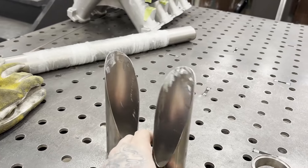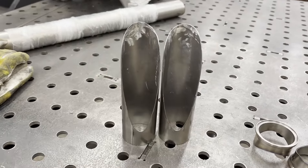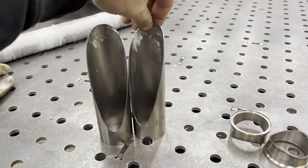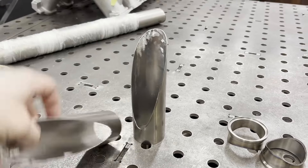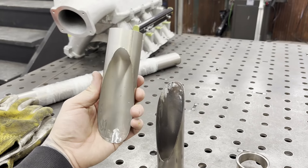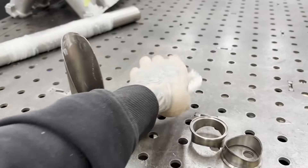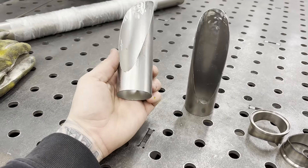This trunk section and straight section are definitely staying in their final position, so any modifications will happen elsewhere. That's why I'm doing the BOV placement now — it'll get two more components placed in their final spot and I can check them off the list. The twin copes are done. They need some final fine tuning to clean up the edges, but I intentionally offset the seam of the tube so when they're welded on, the seam will be as hidden as possible.